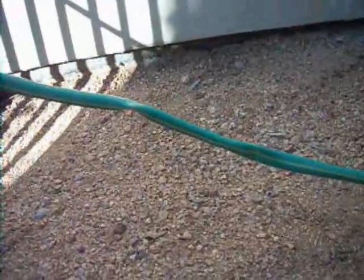This is the foundation inspection. We're actually at the right elevation. We're looking at the foundation itself. Now there's a basement, it's a half basement, it's at the front of the building only. The rear of the building is a post-tension cable slab construction.